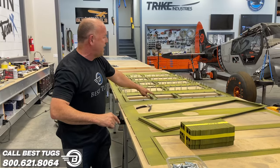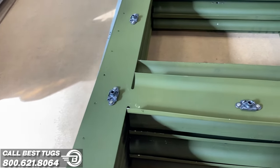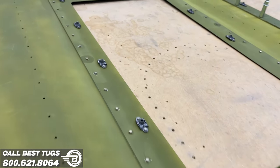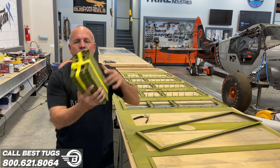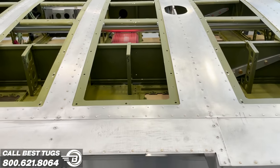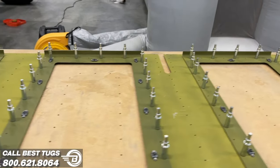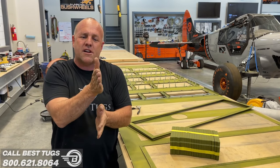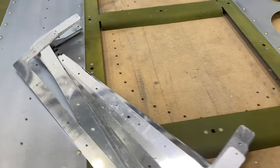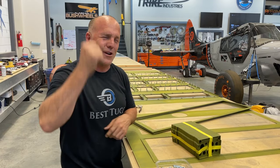So it bolts down at all these nut plate locations and has cross pass through nut plate locations to pick up the middle, the shelf at the front and the back, and then right here where you see a missing support stiffener right there, that's because we use these. These are a combination solar panel mount bracket comboed with the attachment. You can see the rear spar passes through it, every other main rib, so it adds additional support to the spar that is passing through it all, so the spar can't begin to bow one way or the other to keep that spar even stronger. So it's spar support, mid-rib location, solar panel mount. It'll make sense when I'm done. You guys know the drill. Back to work.